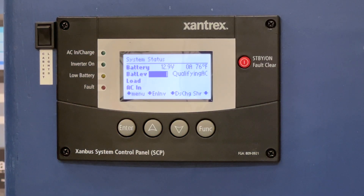You've disconnected from utility or grid, but your inverter didn't enable. That is because if you've disconnected from battery power and reconnected to battery power, by default, the FSW is only going to be in a standby mode for inverter. The invert mode will not be enabled.